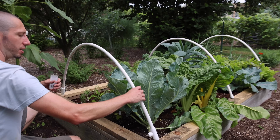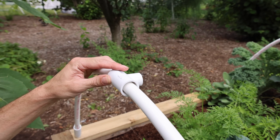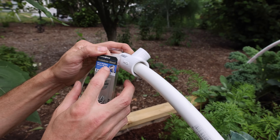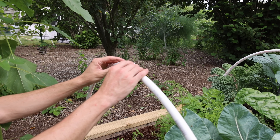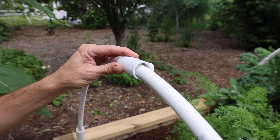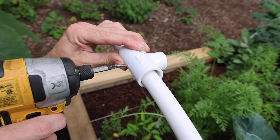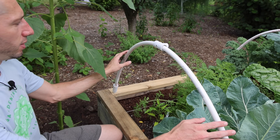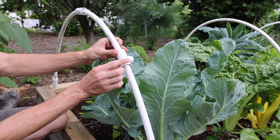What I'm going to do now is screw these pieces just like this — attached so it can hold its shape. I'm going to use three-quarter-inch stainless steel screws, so they should be fine with rust and weather. First I'll center this top piece by eye, then pre-drill, then take the stainless steel screws and attach them. This will help hold it together so it doesn't slide up and down on me. I'm going to do the same thing on both ends. I'll center by eye — looks pretty good right there.